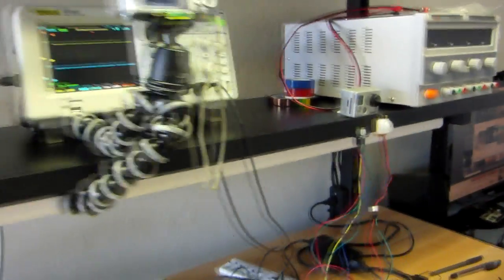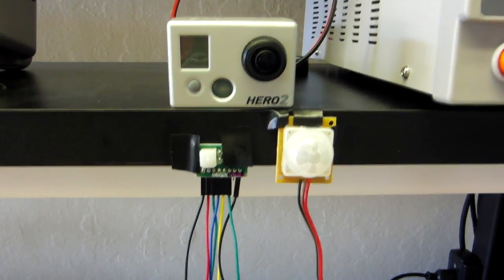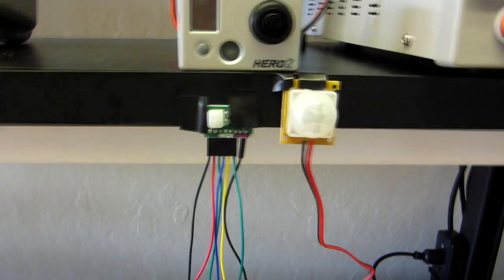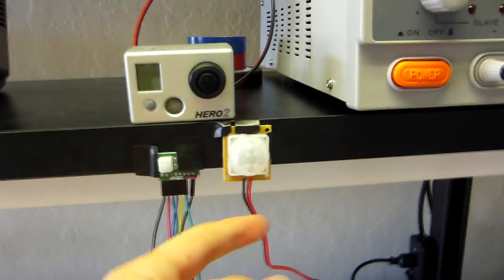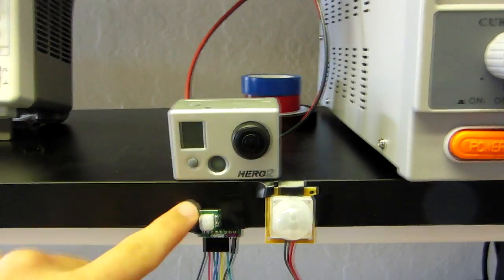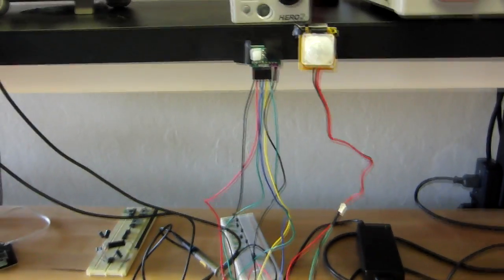Here is my setup for testing the PIR sensors, the motion sensors from SparkFun. There are two different ones, both about $10. This one has serial out and you can configure it in all sorts of ways. I'm using it right now in analog mode with sensitivity turned all the way up and the minimum delay. This other one doesn't do anything special.